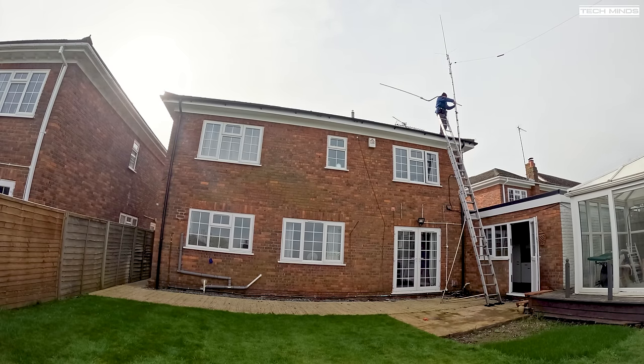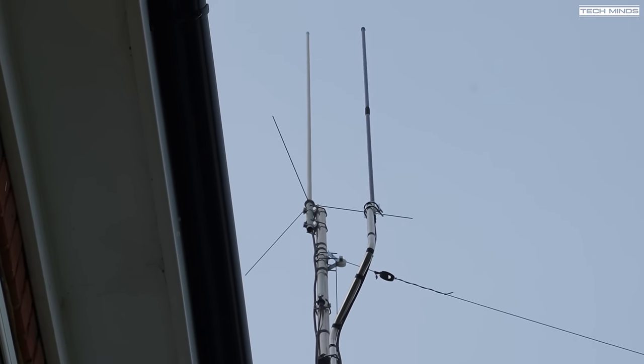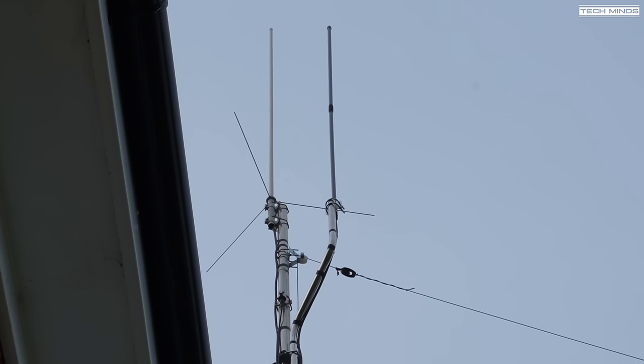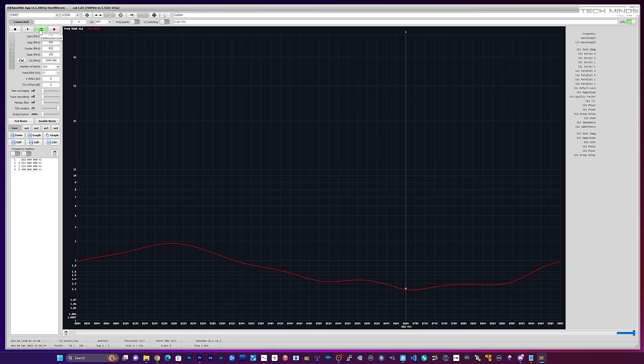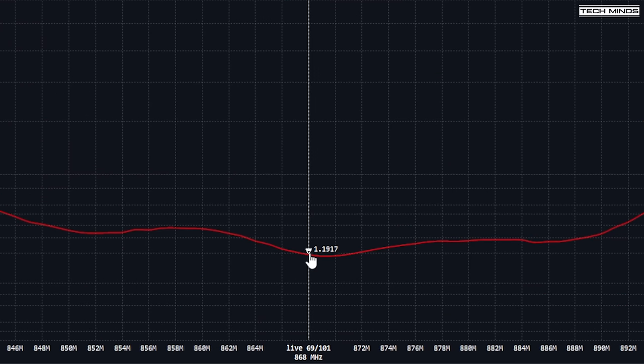I was concerned about the antenna being so close to my other tri-band vertical antenna, but since installation I've seen no performance issues — the SWR on both antennas was exactly as expected. Here it is: the Paradors 11.5 dBi vertical antenna, 220 centimeters tall. Back inside with the coax fed through the wall, I checked the SWR using my network analyzer and got a lovely plot of around 1.1 at 868 MHz. It's also quite broad-banded, with a little give either side of 868 MHz.